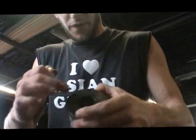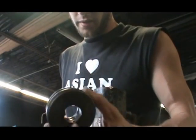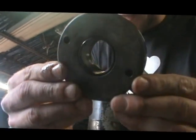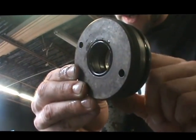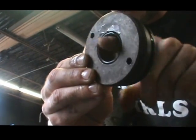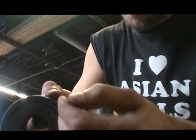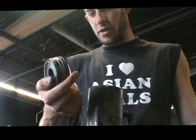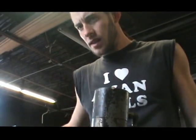They usually get a scuff or something on the shaft and start to wear, and fluid seeps from this area. I took it over to the local hydraulic place and they had to find me a fitting and order a new seal for this one. I told you guys they'd be difficult — they always have to order it. I didn't want them to put it in, but they went ahead and just tapped it in. Inside there's a seal, a metal spacer, and then another seal. You tap them out in one direction and they come right apart; tap them back in the same way. They charged me 20 bucks to do that — new o-ring, inner and outer seals ordered.